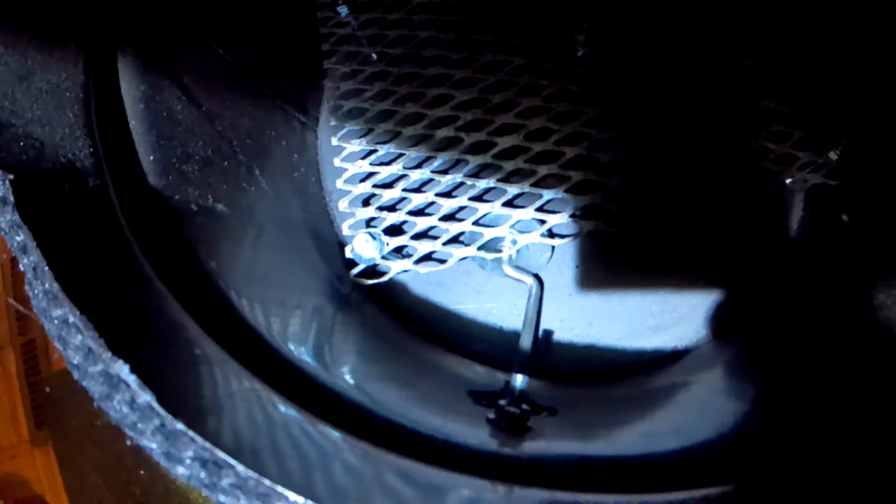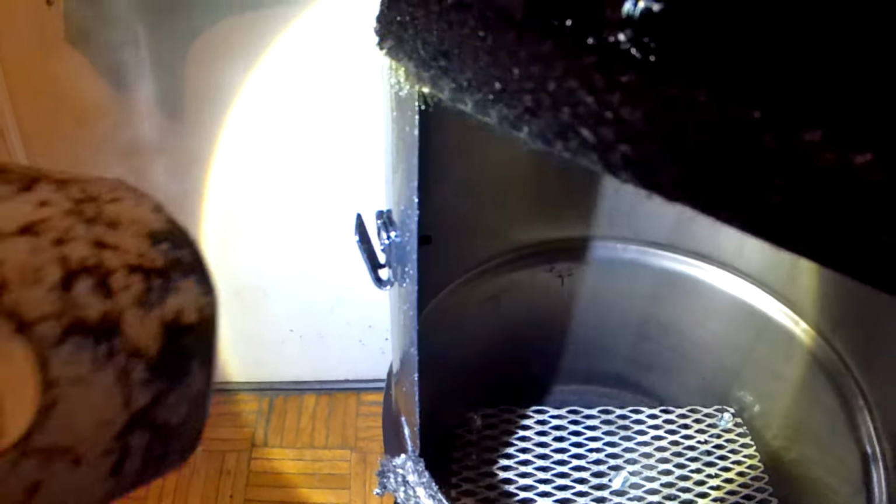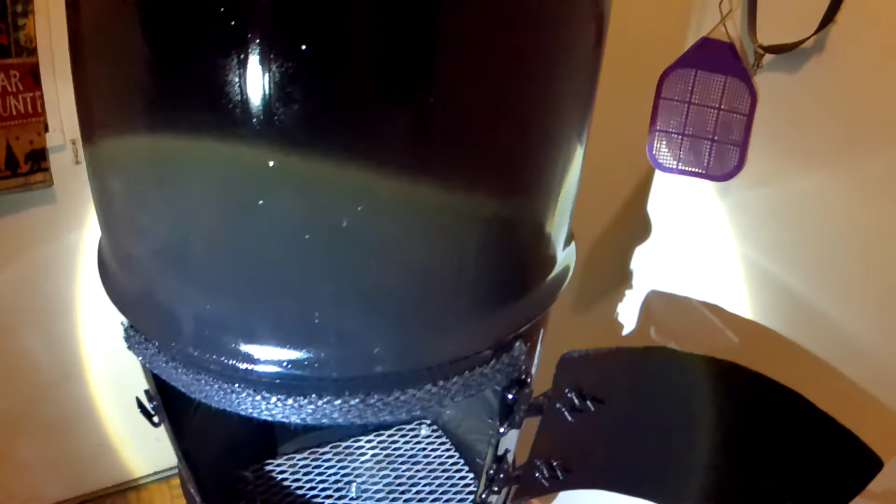And let me give you an inside look at that damper. You can see it there. There's the top of my stove. There's some door detail, and there's the latch part of the hinge, which is just folded over, banding, drilled out, bolted. The whole stove's been painted in high temp stove black. It's a very harsh environment. Any firebox, you have alternating hot and cold, moisture, dryness. You want to try to protect your unit the best you can with anything you can, because it will rust and corrode out for sure. And you want to fight that with a barrel stove. That's not particularly heavy gauge steel to begin with.